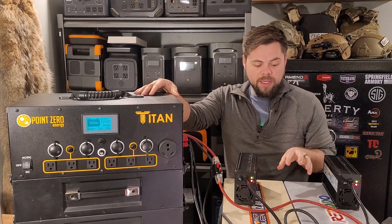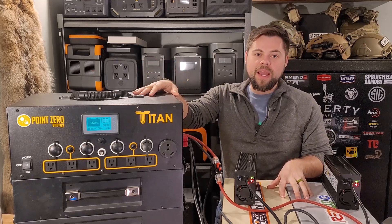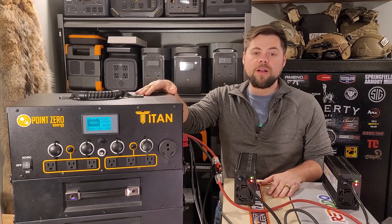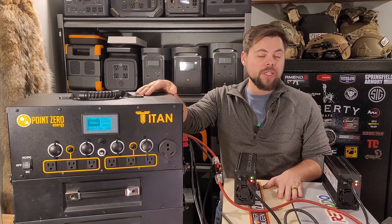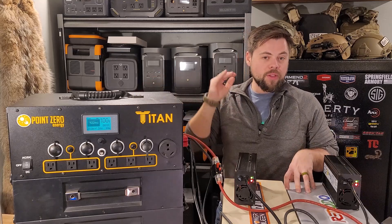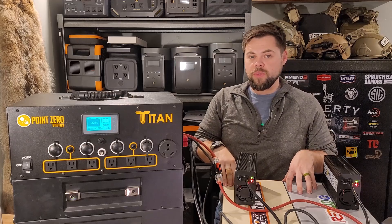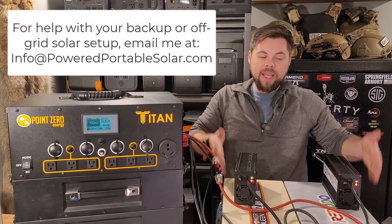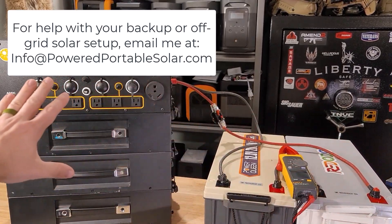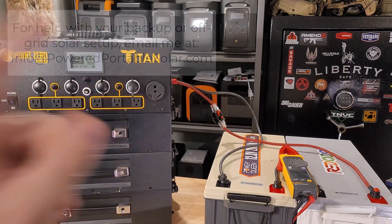What I'm going to do now is see what voltage the battery is at on the Titan screen and on the external meter. Then we're going to leave this all night long and see if it changes at all in the morning. It should adjust quite quickly because the voltage on each of these batteries likes to be at 13.5 volts for 100%. Right now we've got it at 14.5 volts each, collectively at basically 29 volts. So I'm going to leave this whole setup for at least 12 hours.